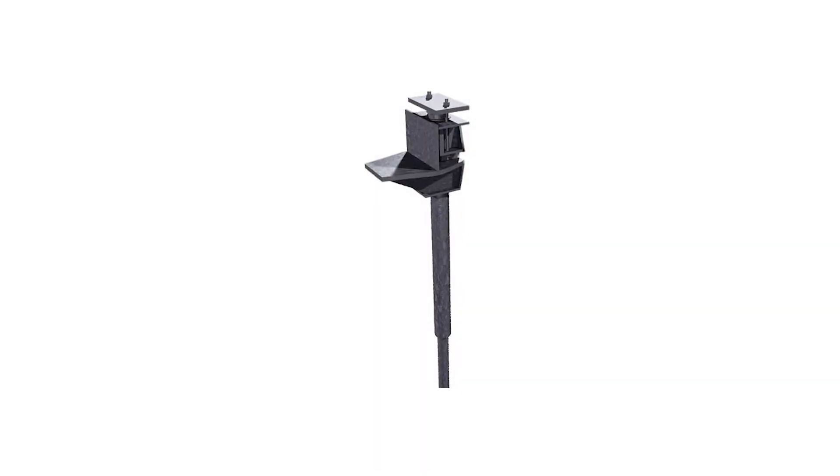The difference between push piers and helical piers are essentially the difference between a nail and a screw. When a push pier is installed, there's a cylinder that's bracketed to the broken footing of your home in order to force these piers down into place to find the tightest soil that it can. Unfortunately, with a push pier, you can only go as deep as the house will allow that pier to be pushed.